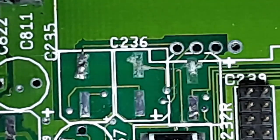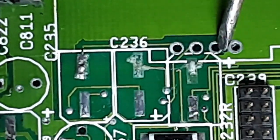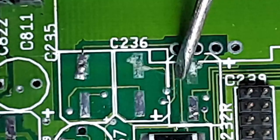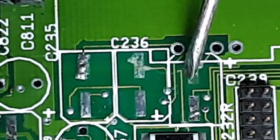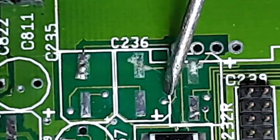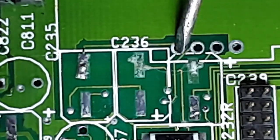Okay, so I've removed the RF box, and you can see this pad here. I can hardly see that. You can actually see that trace that runs up here, comes up here to this one, and it goes down there. And you can also see this one here, look, just there. I'm presuming that one came across to this pad, but I'll have to have a look on schematics for that. So you can see this one here that's gone, and that trace comes along here and down to that via. And you can see the one that's loose up here, that trails up to the top of there, tracks all the way along here, look, and comes into this via here.